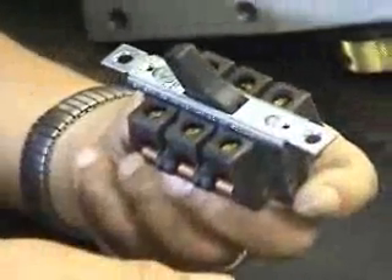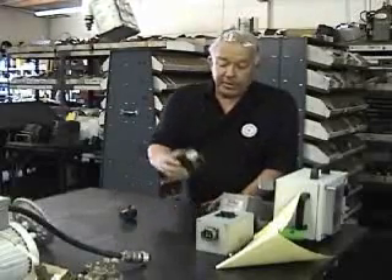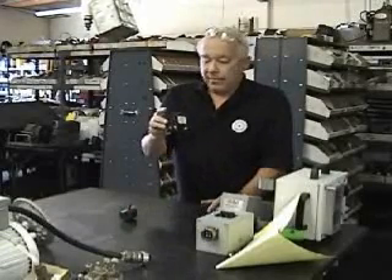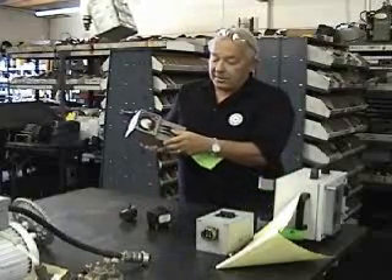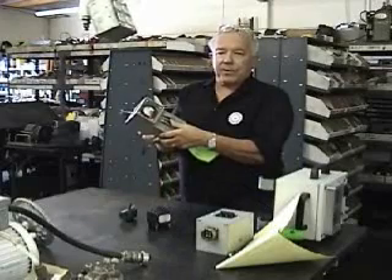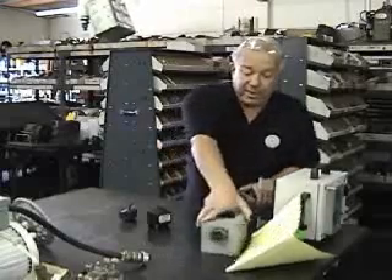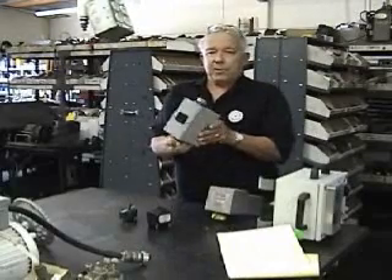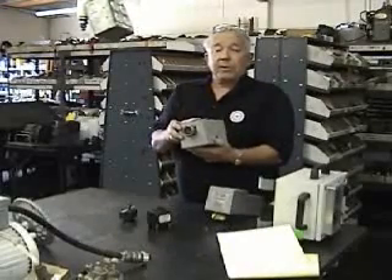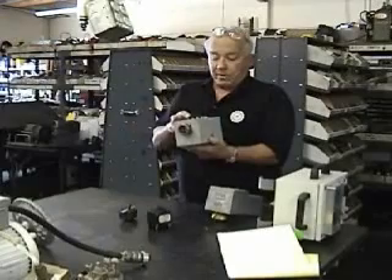To control these 400 Hz motors, it's quite simple. We can use a basic three-phase switch, which are available from several sources. We use small circuit breakers, also available from several sources. We can make boxes that have either a simple switch or a circuit breaker with a load meter so you know where your load is, or a simple box with a circuit breaker that will shut off in case of overloads as you approach the limit of what your motor is capable of.